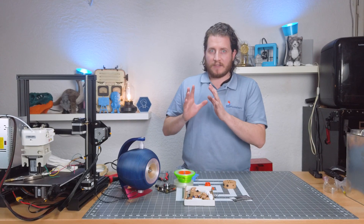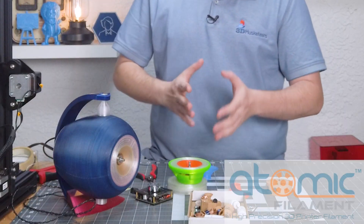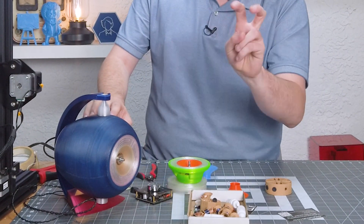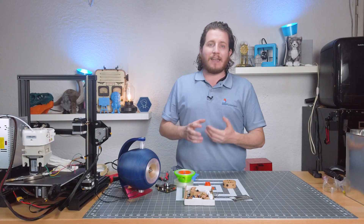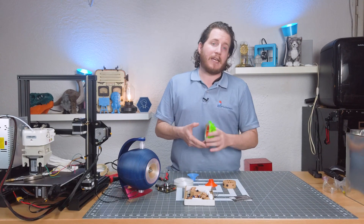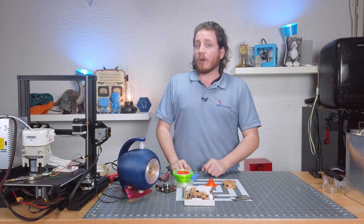This project astounds me. Not only does this look beautiful, it's printed in a ton of different filaments because we could. The enclosure is Starry Night PETG from Atomic. The rear is their translucent metallic rose gold, as is the basket. The surround is clear TPU, and then we have wood fill for the cone. I wanted to test whether wood fill actually provides any benefit over something like PLA. We've always done the baskets out of PETG, but technically you can do most of this out of PLA.